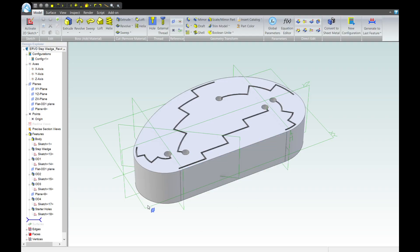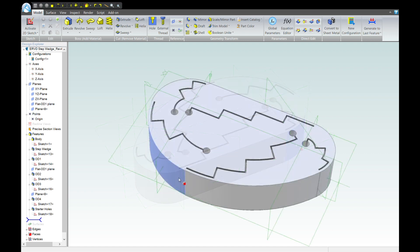The design of this block is based around compound curves which are stitched together at tangent points, and the EDM wire cut paths which serve as the steps. These holes here are the starter holes for the wires.